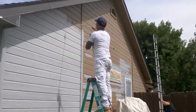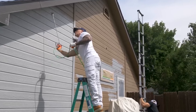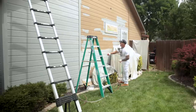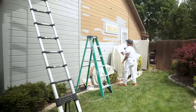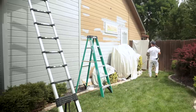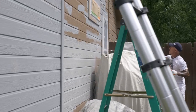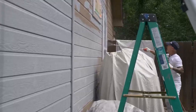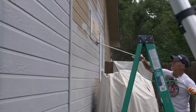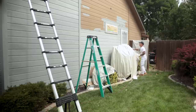See my nice steady speed, nice overlap. I can hit my soffit while I'm at it, just like that. My logical start and stop point now is behind this plant. Once I get over the top of the plant, I'm going to walk my distance — my logical start and stop is this window. One of the major benefits of a gun extension is you can see my reach is so much farther and I can reach through these plants.